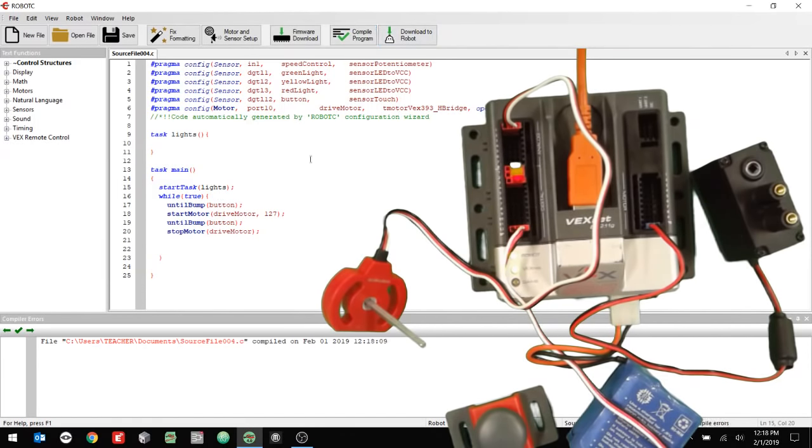Okay, so I'm going to push start or stop, and I'm going to start it again. My potentiometer is at zero. Okay, nothing turned those LEDs off, so I have to click stop here. Okay. All right, we want to turn those LEDs off. So let's just do another if. We'll do if sensor value. So I'll just copy this right here. In coding, copying and pasting a lot can really help you. So I'll say if it's less than 1000, it's going to turn all those lights off. So I'm going to download that.